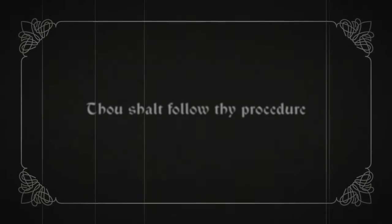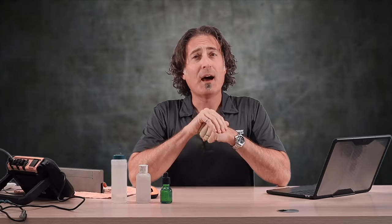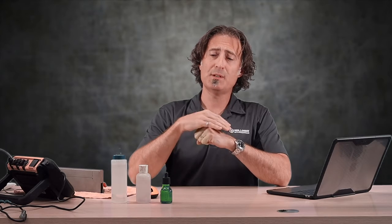But does this actually make any practical difference? The finger pressure in conventional manual UT, or the spring tension of a scanner wiggling and jiggling its way around the pipe, is probably going to produce more variability in sensitivity than changing the couplant. I think this is one of those things that, on the surface, it makes sense — but once you spend some time experimenting, the practical differences you're going to see are minimal.